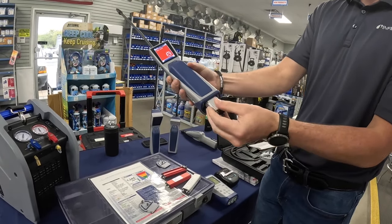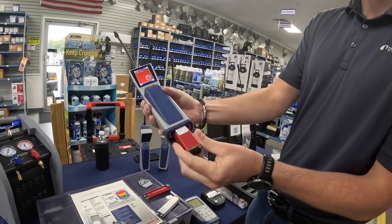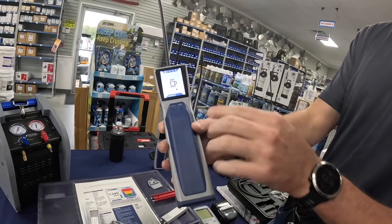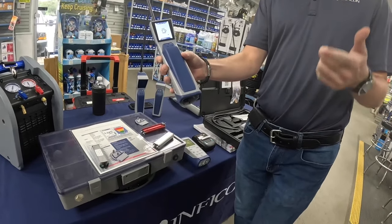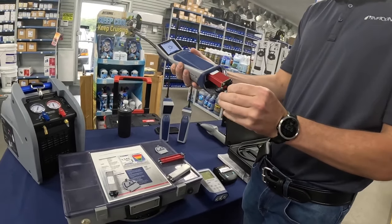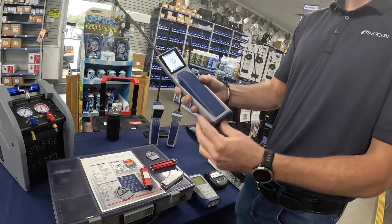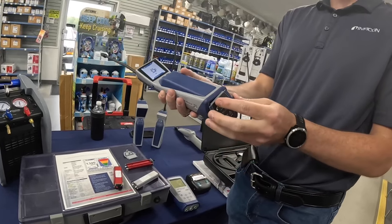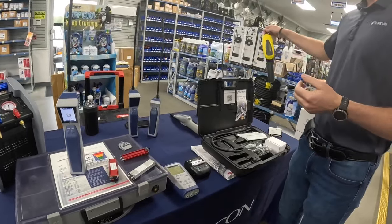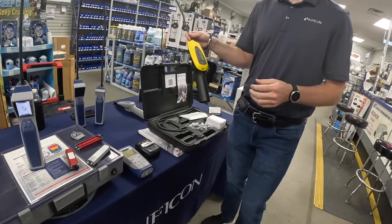I've seen the screen of death a couple of times. Now if I take this sensor out and throw in my hydrocarbon sensor — the flammable sensor — you'll see a little flame indicator up here at the top to the left of the volume bar. That tells you you have your flammable sensor in, so you can go use it for R-290 or R-600. It won't do natural gas. For natural gas, we recommend using a certified intrinsically safe leak detector — our gas unit. It doesn't create any heat or spark, and all the electronics are covered up.